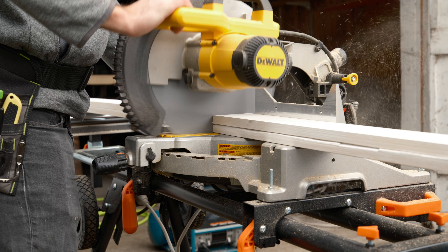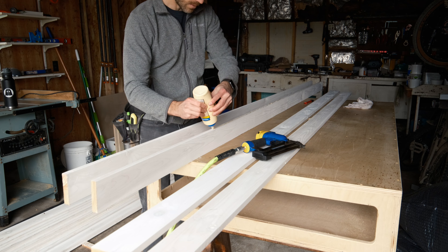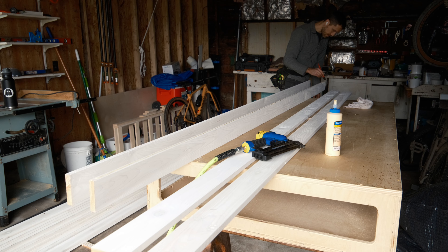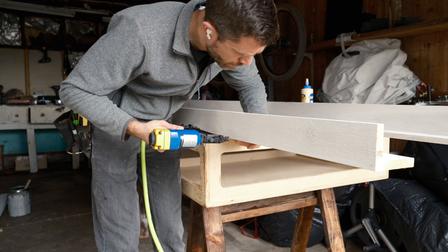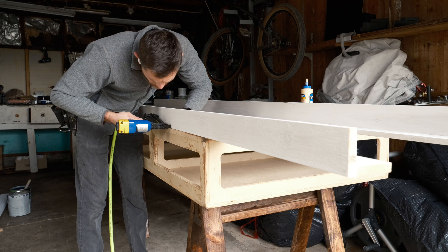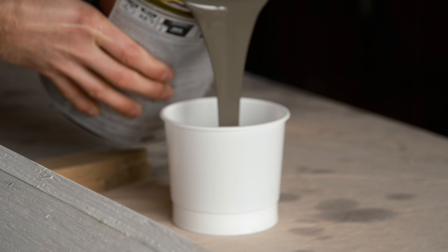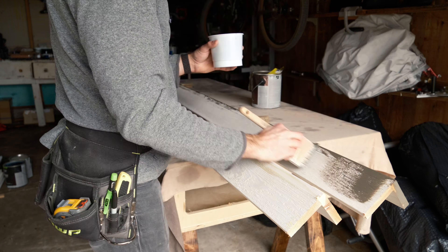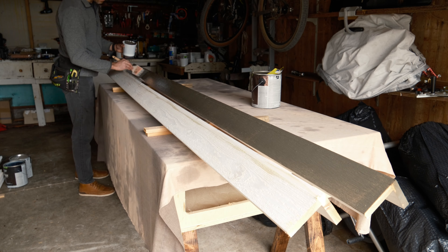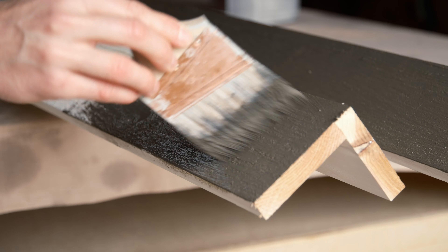After the paint, it was time to move on to pre-constructing my corner trims. I just rough cut them to length, then used some wood glue and brad nails to secure everything together. I was really looking forward to getting these on, because after doing so the shed would finally be pretty sealed up against the rain, eliminating those big corner gaps in the siding panels. I know construction doesn't just stop during the winter, but I just have no reference for how much rain building materials can take before it starts to be a problem.